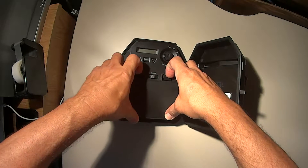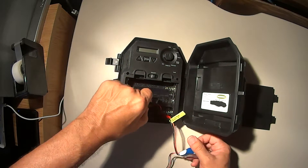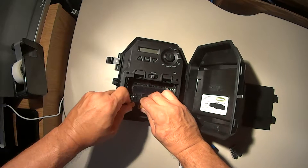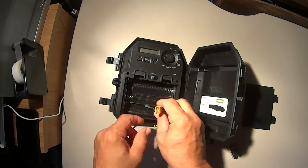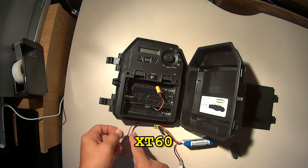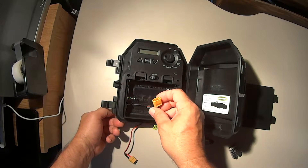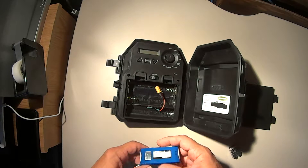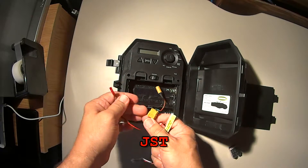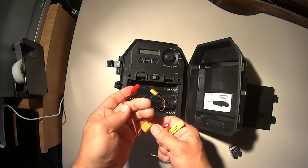What I'm doing is putting a LiPo battery in here instead. I needed to get it underneath the battery compartment itself. All I did was put on an XT60 plug, and this went right down to where that auxiliary plug plugged in. Depending on what kind of battery you use, I'm using a smaller JST plug. But I wanted to make this universal because I have other batteries with XT60 plugs, so I just made an adapter for it.